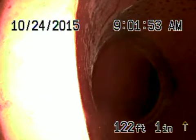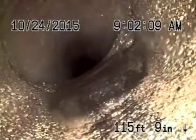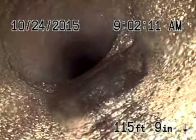We're all the way at the city sewer. It looks like the city put in a new Y for you. This is a brand new piece of clay, and as I bring the camera back, it transitions to a concrete pipe. This is a six-inch concrete pipe out in the middle of the street, which all looks like it's in pretty good condition. There's a little bit of mortar coming into the pipe — that's not a big deal.